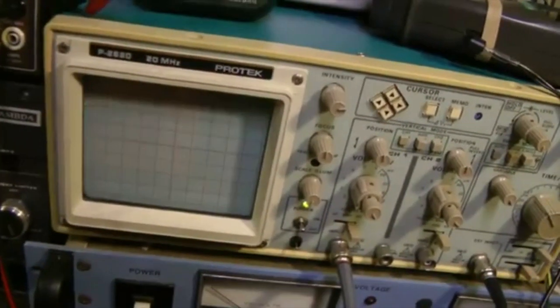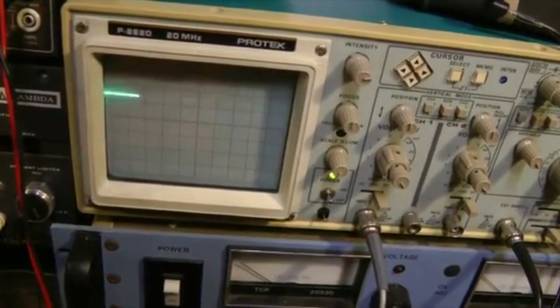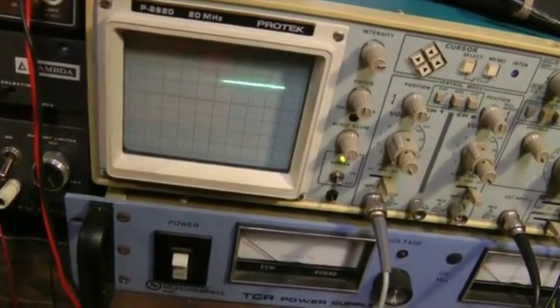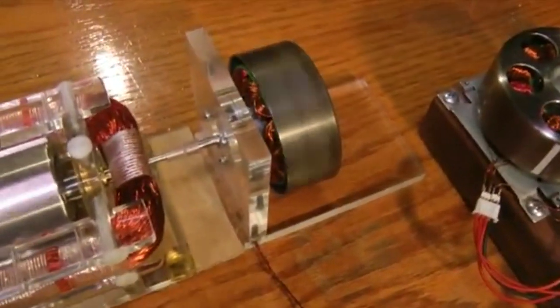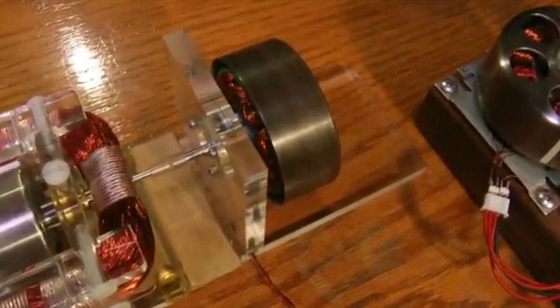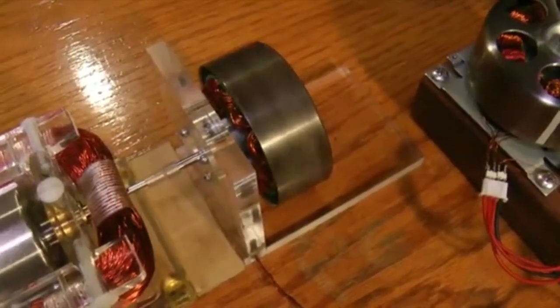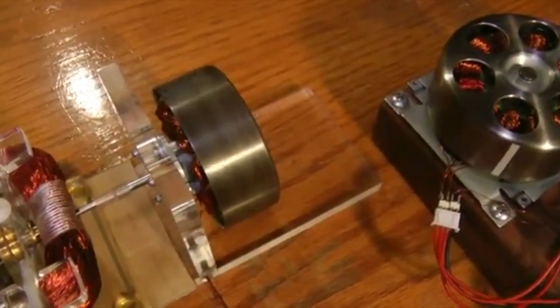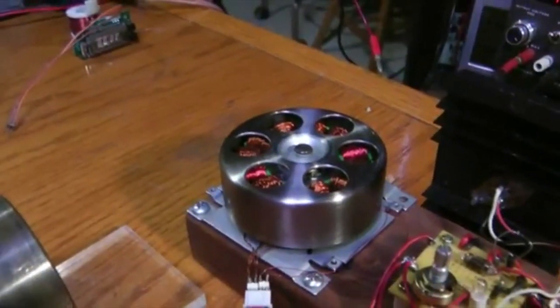Now, do you think this 8 volts would charge a 12 volt battery? Not. And it's a far cry from 400 too, isn't it? So much for the concept that, oh, you can get high voltage anytime you spin a DC motor. Spin it and the voltage comes pouring out the other side. Not quite. Not when it's running like a conventional motor, generator like this is. You can see what it can do with this RPM. So now we're going to hook it up to the other circuit.